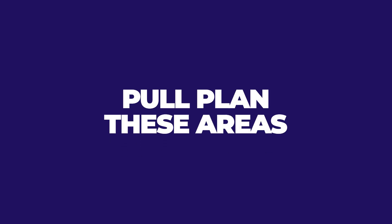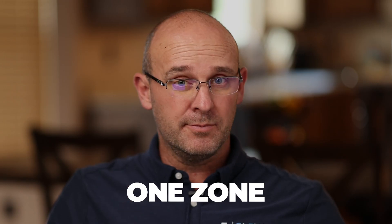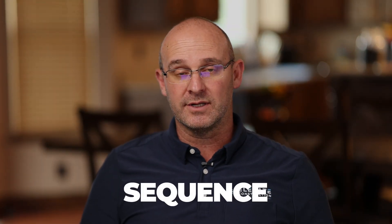The other horrible myth in the industry is that you pull plan large areas — like 'I'm going to pull plan the floor,' or 'I'm going to pull plan that whole phase,' or 'this massive area.' No, you don't. You pull plan a single zone in a phase, a small area in a phase. So if you're doing the interiors, you do one zone. You should be pull planning five to fifteen thousand square feet of area, nothing more. Then you put together that pull plan and you can go forward and back to create that nice sequence. When you go forward, that takes care of the job; when you go back, you get all preceding tasks and needs taken care of. So you have both persons' needs met.